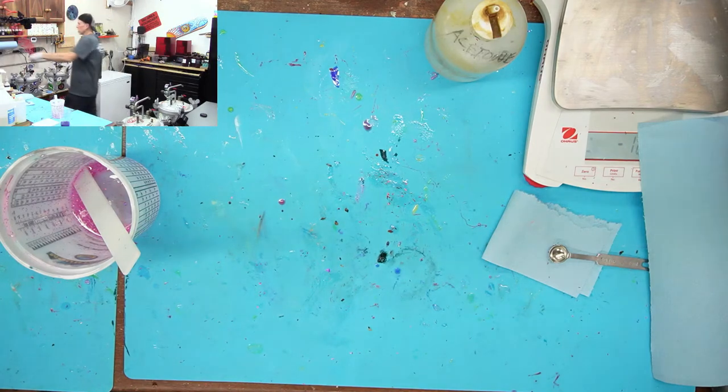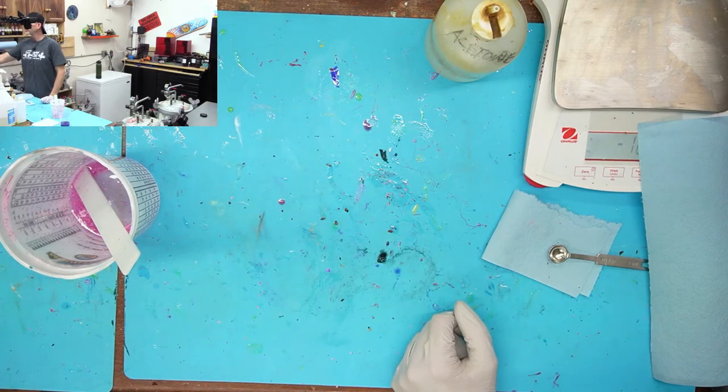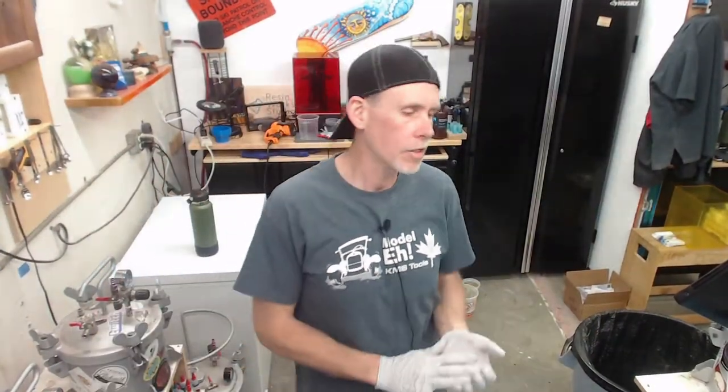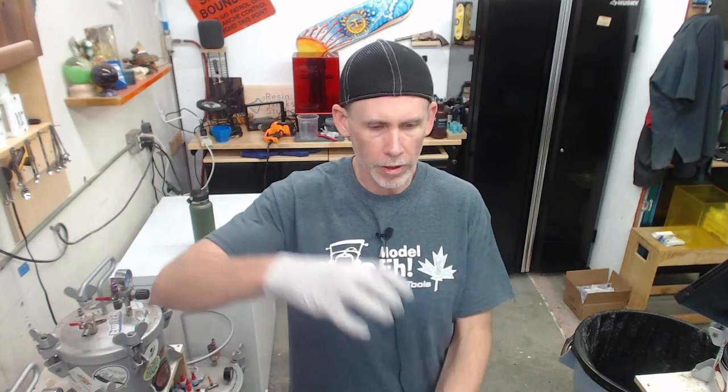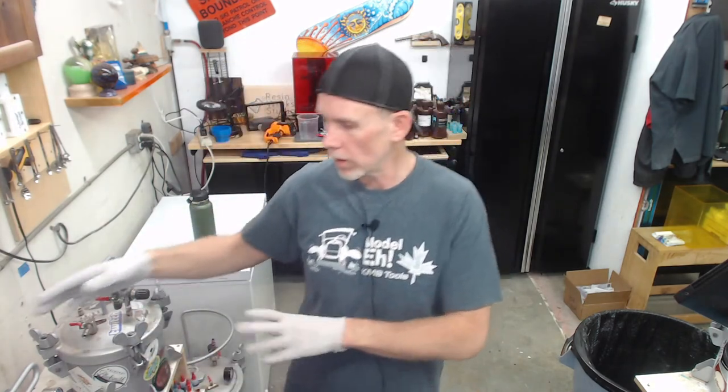And in some cases, if it's just a very small amount of resin, like, I even do this for pen blanks just because it ends up being a little easier to demold them, to get them out of the pipes. So if I'm pouring vertical pen blanks with Alumilite clear slow, in the 3/4 inch PVC, I usually leave them in overnight.